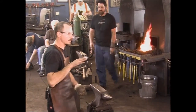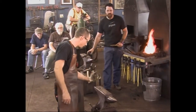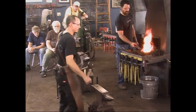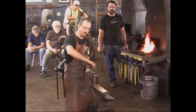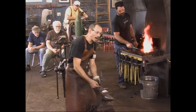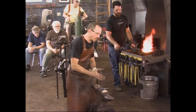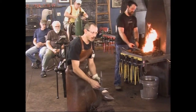So what I was saying earlier about working the power hammer is different. Here working on the anvil, we're shaping the hardy shank first, setting it in the anvil so that we can do our upset. And working in the power hammer, it's different. I start upside down and I do the upset of the web first. This being the original flange, this being the mast that the wheels rolled on. I set him in the power hammer on the die like so, and I start hammering with the web hot. And I work to upset that mast first because I don't have much height room to work in the power hammer, and I'm kind of relying on that flat surface in this to drive that mast down. That's the most efficient way I've found yet, so I reduce that first when I'm working in the power hammer.